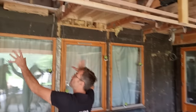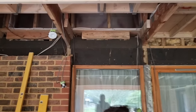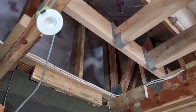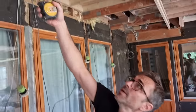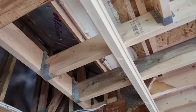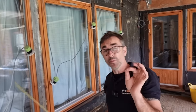Where we've stripped back the existing building, we've exposed part of the loft upstairs which is an uninsulated space. You can see here the back wall of the bedroom — before, the insulation came all the way down the roof, the insulated envelope, and across these joists. What we need here is not necessarily thermal insulation, but I want to put sound insulation on that wall.